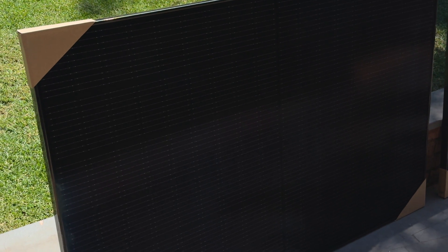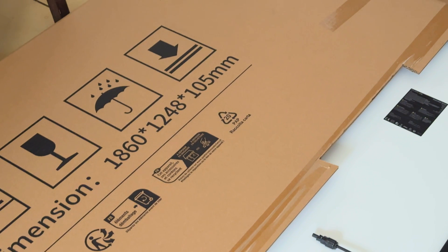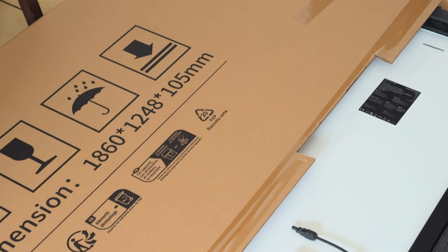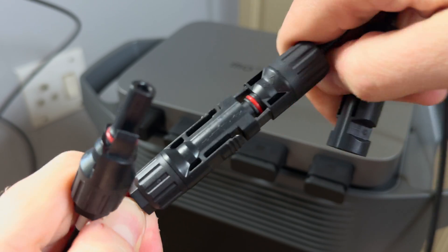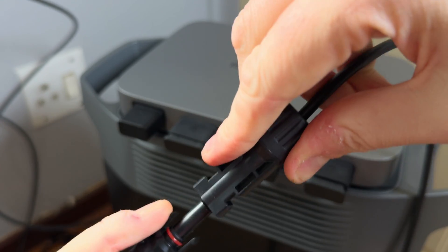While I didn't use any of these, I do respect how EcoFlow is trying to make this as DIY as possible. If I were in an apartment with a balcony, all of this would have been incredibly easy — I would have mounted the panels to the side and run the cables through a window. The route I had to go wasn't as easy because I had to put the panels on my roof. I took these two large 400W panels and mounted them onto my roof, purchased 100 metres of 4mm solar cable, learned how to attach MC4 connectors by crimping them onto each end, and then ran the cables through the roof and through the air brick before attaching them to the connectors.